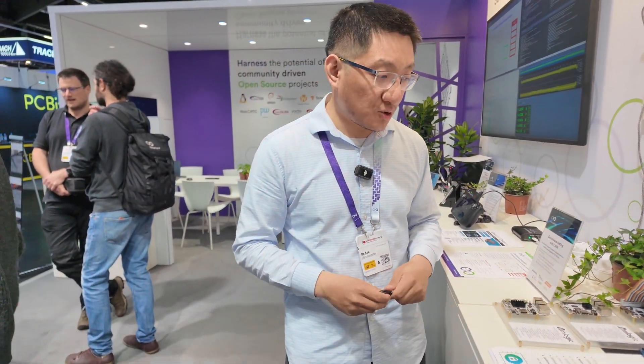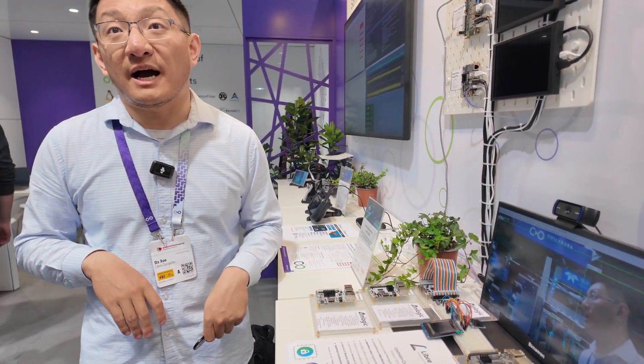Have people put your boards in robots? We've integrated with a bunch of sensors. In terms of control systems, you use PWM to control them, and SPI or I2C. We don't do any of the complex ones like EtherCAT or CAN bus, but for basic robotic control using GPIOs and I2C expanders that have robotic controls, we do have a lot of people that use those.